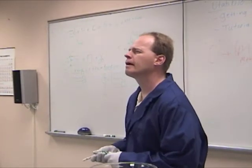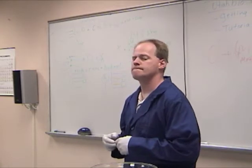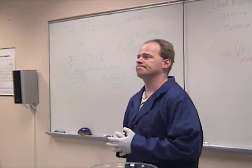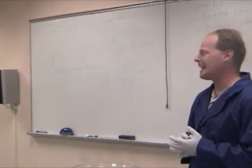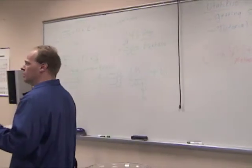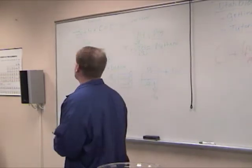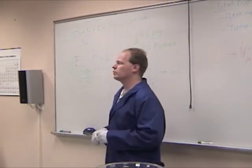Isn't there a consideration of the flash point of methanol, if it's too hot, it starts a fire? I'm sure there is. I've never seen it flash in all the time I've done it, and I don't want to either. Once it boils off, it just turns into vapor, and even if it's a closed tank, it's not going to help. If it's a closed pressurized vessel, it'll come back in, but you don't want it in a vapor. You want it in a liquid to make the reaction go.